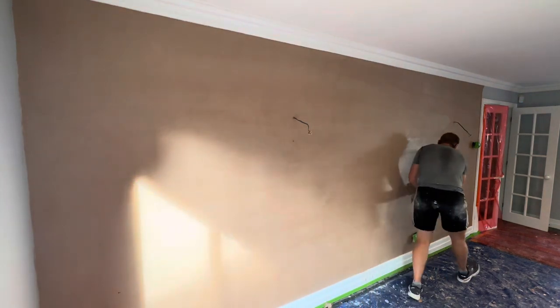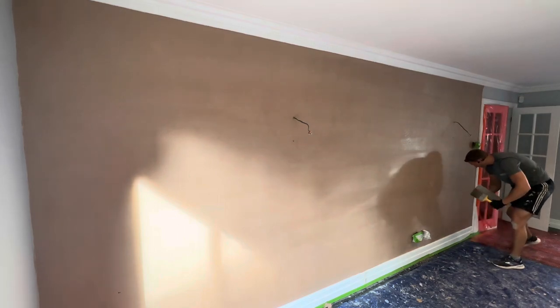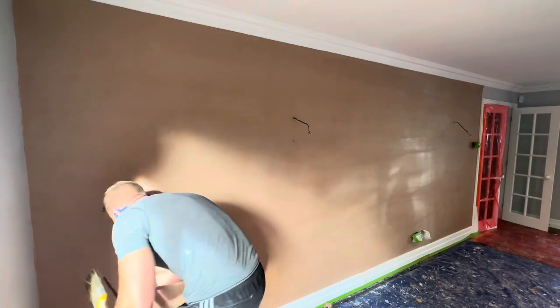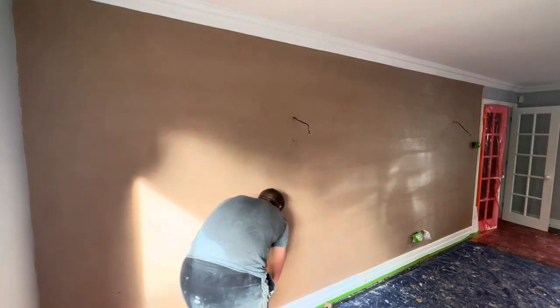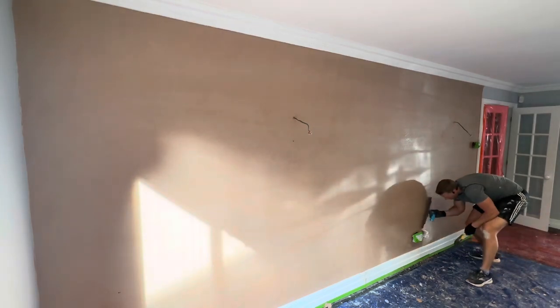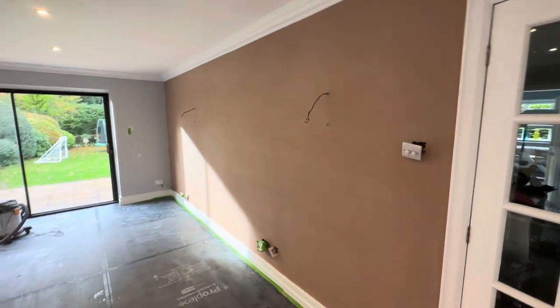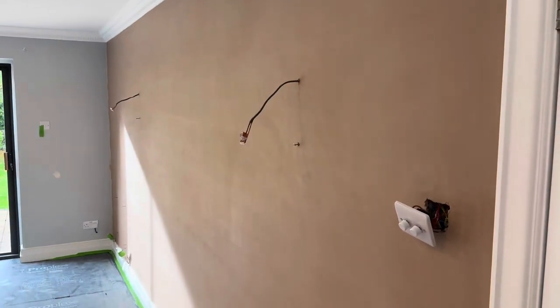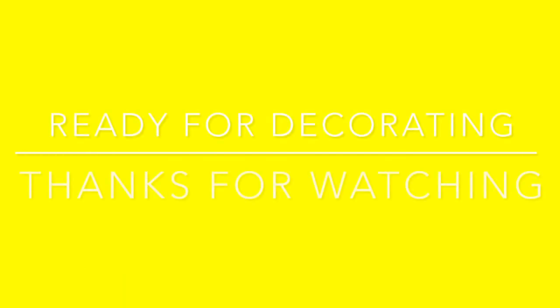I've now removed the radiator screws as I polish the wall, because at this stage there's no chance of those holes filling up — so it's perfectly safe to whip those screws out, go straight over, and then pop them back in at the end. And that is one finished, freshly plastered wall. They asked me to stop just above the door there because the builder is going to do the decorating and fill that nicely. I hope that was informative and helpful — thanks for watching, and if you did enjoy it please subscribe.